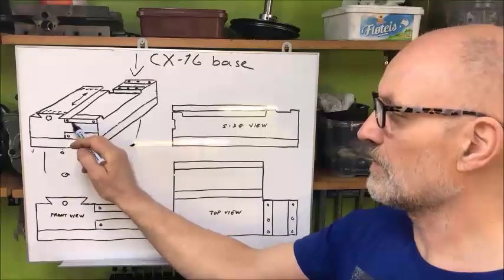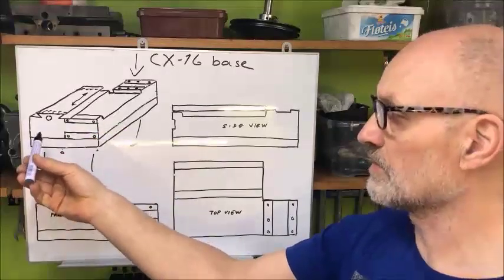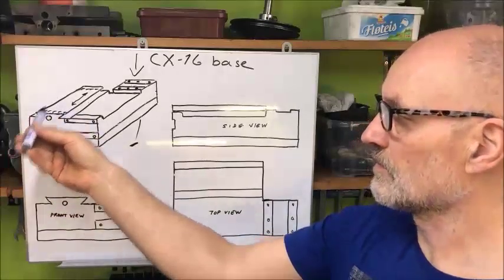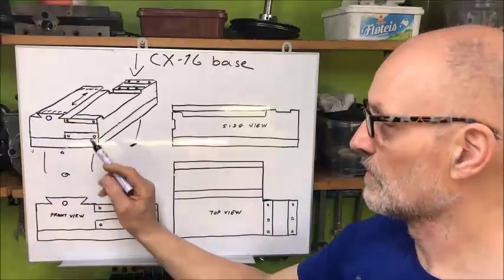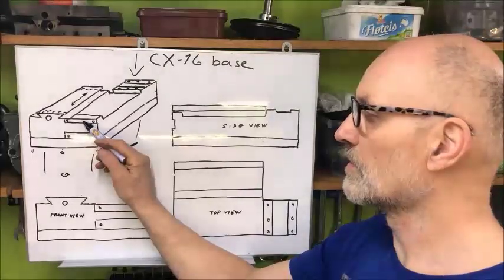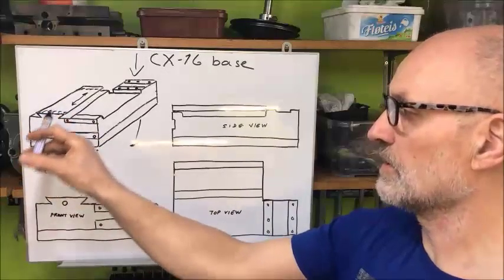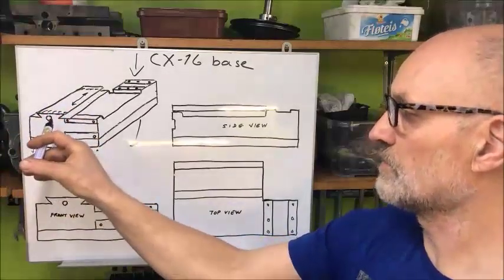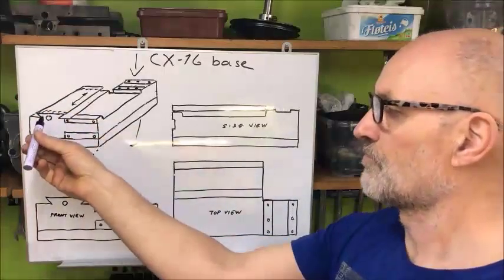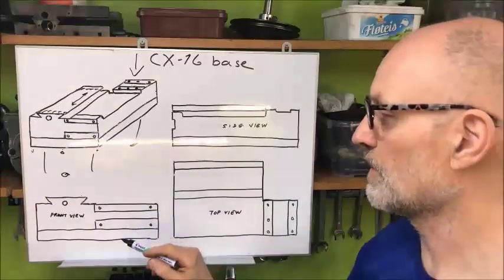The flats on the front here are for the tailstock — the tailstock used as a lathe. There's a tailstock that mates up to these flats here, and the tailstock runs in and out. I haven't bothered with this yet, but of course this also needs to be perpendicular, or perfectly aligned — both here, and also centered, and not off this way or this way.